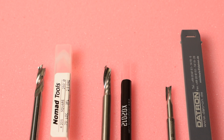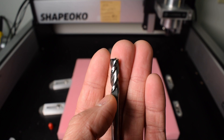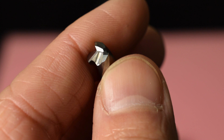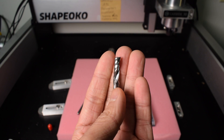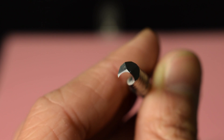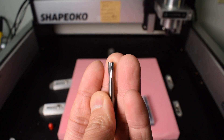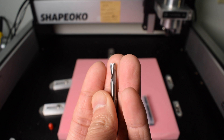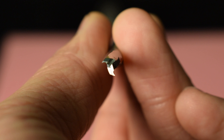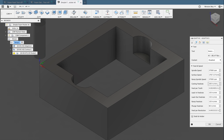Now let's cover the tools. I'll be testing out three tools, only one of which is specifically for foam cutting. In the ring we have a quarter-inch three-flute end mill from Carbide 3D - fairly generic geometry, moderate helix, typical rake angles on the cutting edges. Also we have a quarter-inch single-flute end mill from X-Edge Tools - much lower helix angle, super aggressive cutting edge. This one is meant for plastic so you really want to slice into the material and have generous room for chip evacuation. And last but not least, the legendary Datron Tools 5-millimeter foam cutter - it's got super low helix angles, three flutes, and each one has an extra cut inside the outer edge that also sharpens up that rake angle.